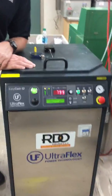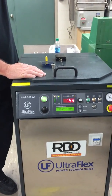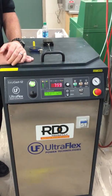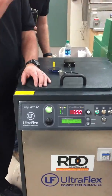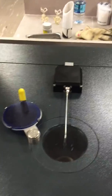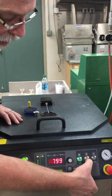What is that, just pumping argon? Yeah, we have nitrogen from a big bulk tank outside, like for all our casters. We used argon for 2 decades. Nitrogen's a little cheaper and just as effective. Yeah, we'll go get it. I'm melting. What does the nitrogen do for this? It's just filling up this chamber. So you put nitrogen around it? Either or, argon or nitrogen. Is the gas necessary? Yes, ma'am. It helps protect your metal from oxidation.